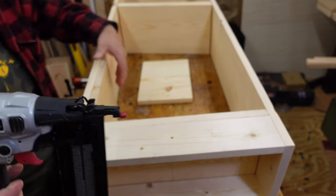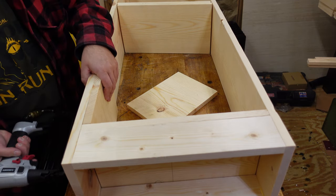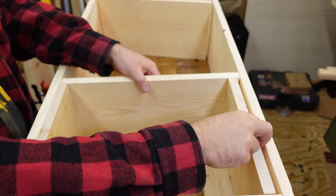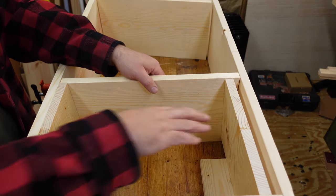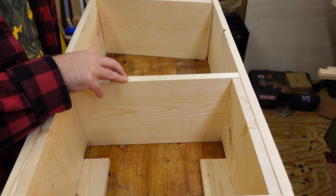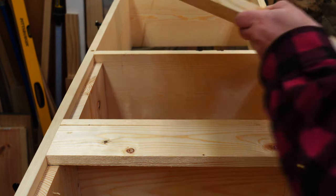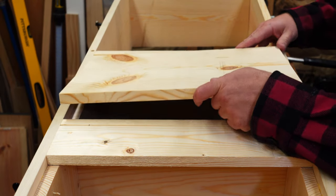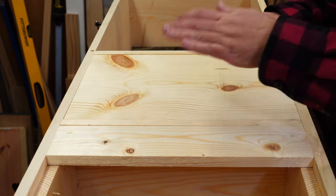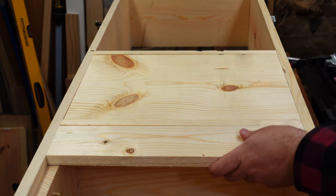A piece of scrap is a great spacer here. Nailing from the inside out works better because of the inertia of the heavier piece on the back. Continue stacking spacers and shelves working from the bottom up. The spacers require glue and nails; the shelves only require a couple of nails on each side. Once you've installed your spacers and shelves, you can install the back panels. You'll notice this is a nice tight fit because everything is cut precisely. These back panels only need to be tacked into place with a few nails.